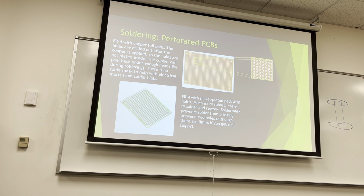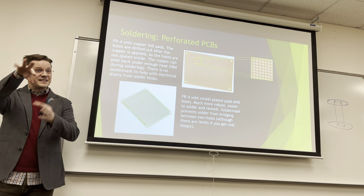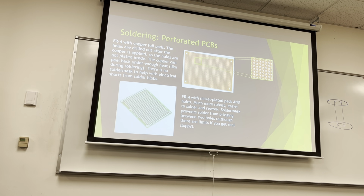If you make a mistake, you have to have the board refabricated, which can take a week, depending on the mistake. So it depends on when you make the mistake, or what mistake it is, because you can technically cut down. You can, if you've designed your board well enough. If you made a super compact thing and you try to dig down, are you sure you're not hitting anything else? It's real hard. If you spread the thing out and nothing's overlapping anything else, then yeah, you could get away with it, but you still have ground planes underneath.